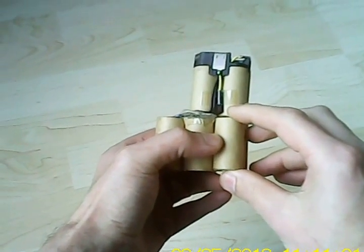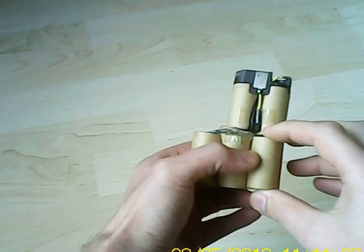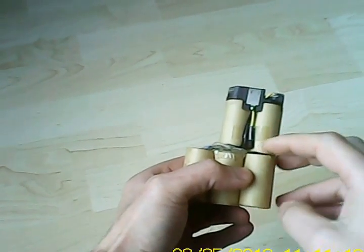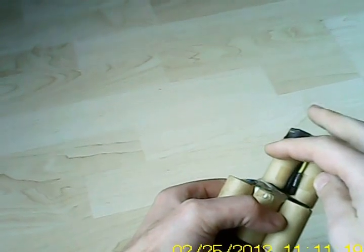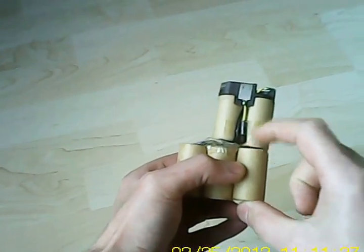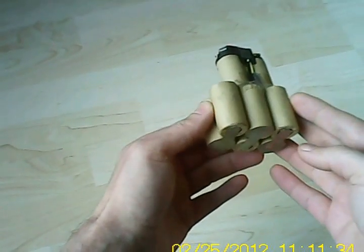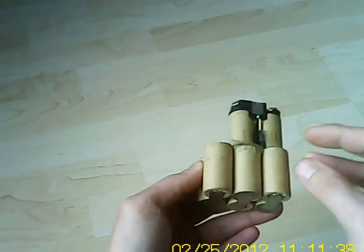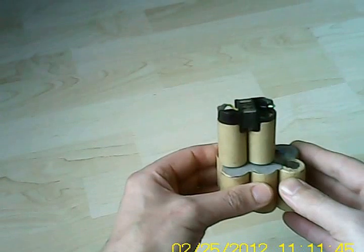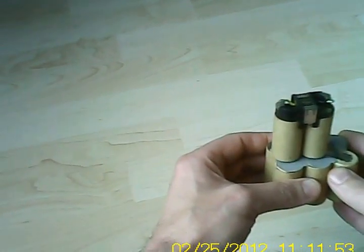The current boost is that I'm going to provide up to 5 or maybe 10 amps for a short period — like a second or so — and several times I'm going to tap it. I will use my super caps, but you can use two regular working cells, so they provide about 2.4 volts, and tap the bad cell with it a couple of times. The idea is to break up any crystals that are inside, which need to be broken so there is no short circuit. These phases may go one after another, and maybe repetitively several times, because they don't rejuvenate the first time.